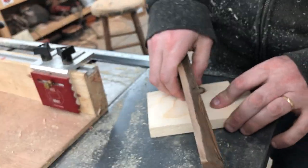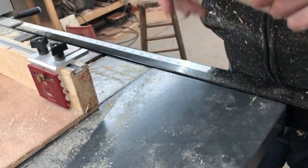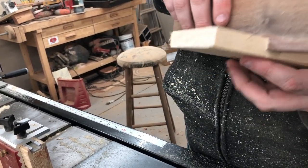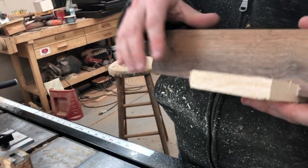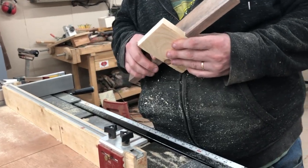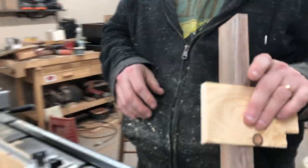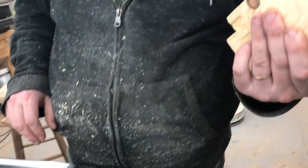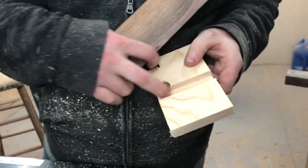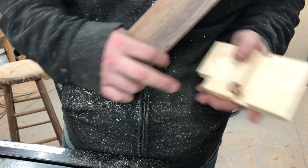Then we just take and hog away the rest of this. Fingers crossed — and that's the dado. That one's a bit loose, but there's no slop in it. You can always adjust that by fine-tuning this part, but for the most part it's dead-on accurate — really no gaps. Although you can go in with a router plane or a chisel and clean that up to make a flat bottom.